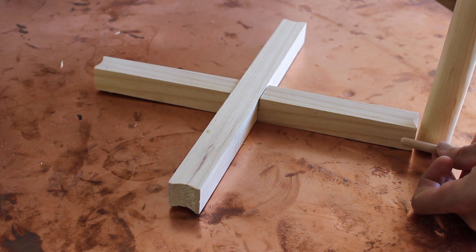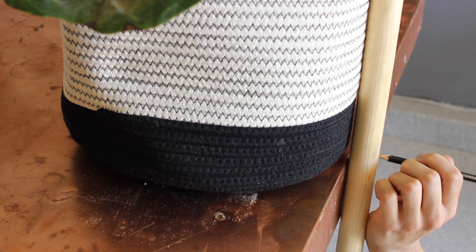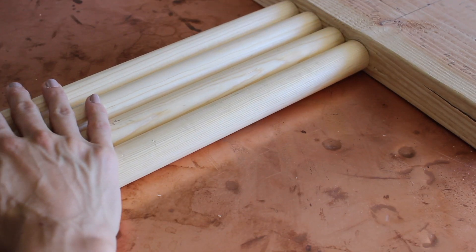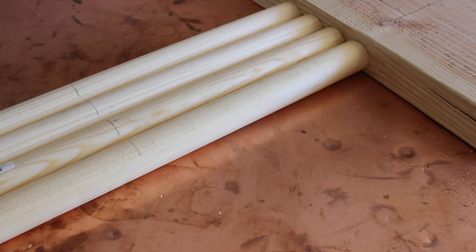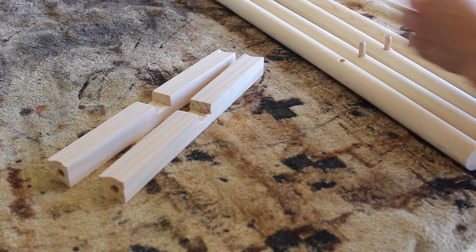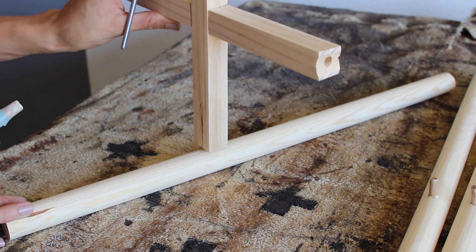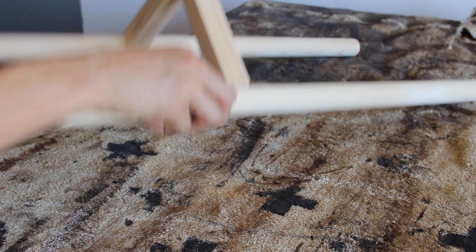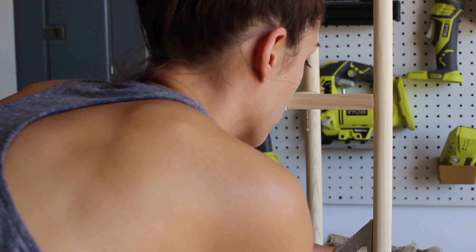Those two connected pieces are actually holding the pot up. Now I need to attach the dowels to the sides with plugs to make the actual stand. I drilled half the length of the plug into the center of the end of the square dowels, then marked where I want the plant to rest — that's totally up to you. I used a straight edge and speed square to mark across the dowels to ensure it's even, then repeated the same drilling process for the plug to connect everything. I did a rough sanding of all the wood, then moved on to connecting this big puzzle with wood glue.